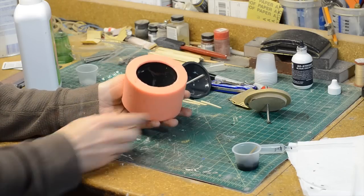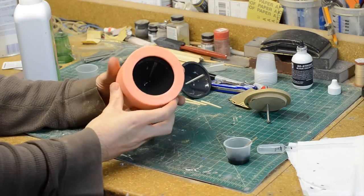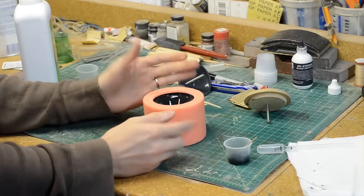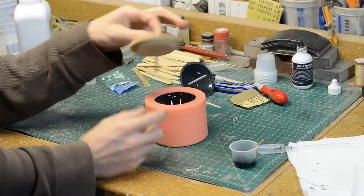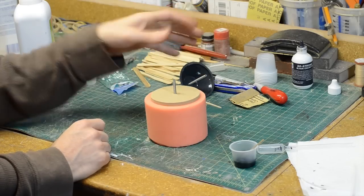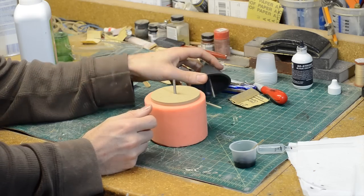This is the mold I made for the mace spikes and right now I'm slush casting them. I've put in three layers of resin — this is just a polyurethane plastic resin. I pour a little bit in, rotate it around to coat the inside, let it cure, then pour in the next layer. For the last pour I pour a little resin in so there's a puddle, then I put this bolt in to keep it centered. The head of the bolt gets sunk into the resin, the resin cures around it, and I end up with a finished spike piece.